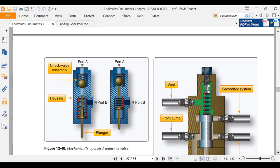Indeed. Okay, so sequence valve. We went out on a hydraulic bench, and you guys made a sequence valve by using a pressure relief valve. Some of these valves are named things like sequence, but they're really something like a pressure relief valve. There's only a couple different types of valves. They're going to port fluid.